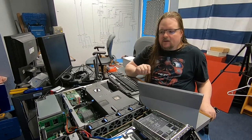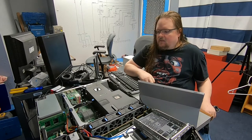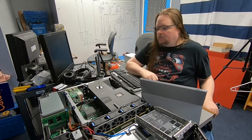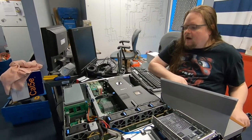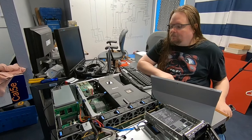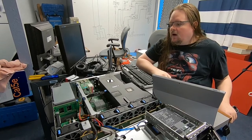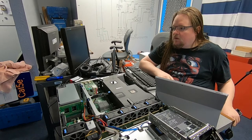If I unplugged it and plugged it back in, it worked for a little bit, but then it would stop. And I figured, okay, maybe the USB bus on this is crap because it's a server and they don't spend a lot of time thinking about USB buses. But I did put this PCIe USB 3 add-on card in. I tried plugging into that. No joy, because it actually needs power. So that's why I had to pry the backplane out and solder the Molex connector under the back. And now it works without complaint.